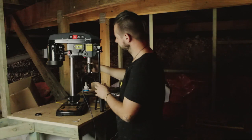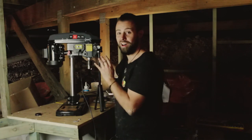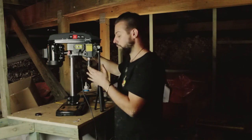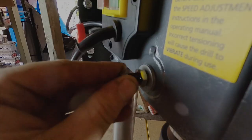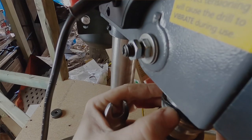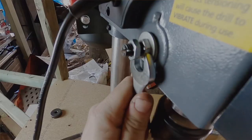Now I need to tighten this because there's still so much play in there. I need to get this thing tight and in the upright position. From here I won't be able to move it up and down, so you need to bring the workbench up into whatever you're milling. I chuck on two washers over the top, put two nuts on there and tighten them up. There's a little rubber seal just in the top and I want to pinch that up so it can't move side to side — as tight as humanly possible.